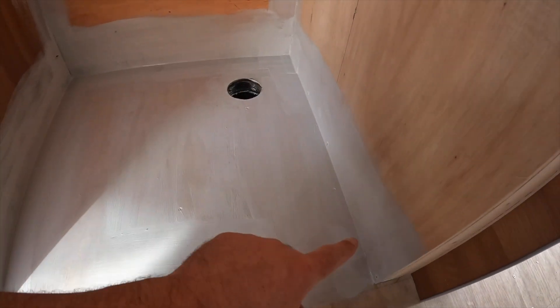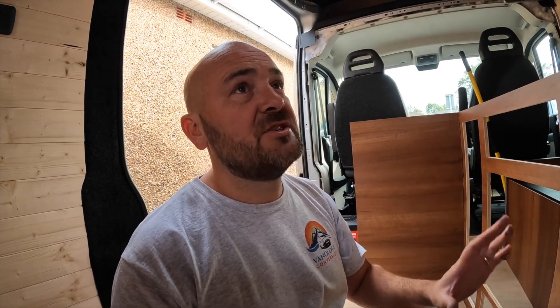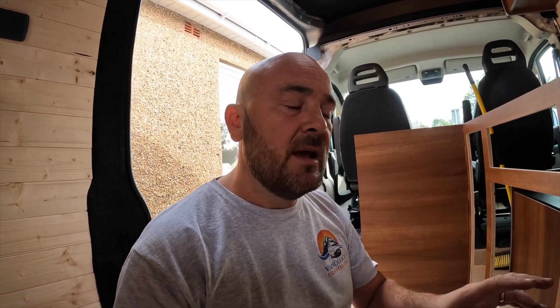I've run the mixture up the walls and I'm about to do a section down here. You repaint it quite thick, get your tape on, and use a flat edge to push it in nice and tight into the corners. Then go back over it all with a brush and more tanking mixture. I do a total of three coats - a base coat, the coat when putting the tape on, and a third coat to seal the room. I also seal between the tray and the tanking all the way around, then install the cladding, and seal between the cladding and the tray again. Two lots of silicone, one lot of tanking - this thing is not leaking at all.